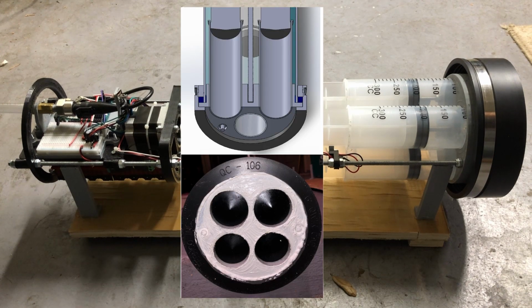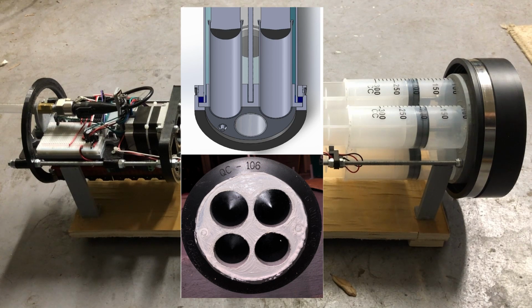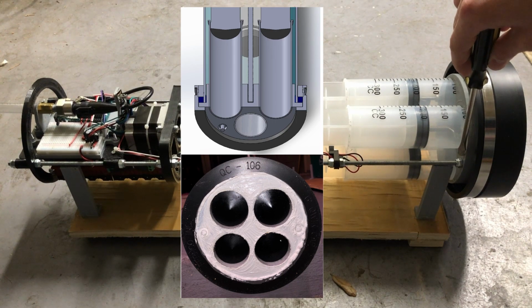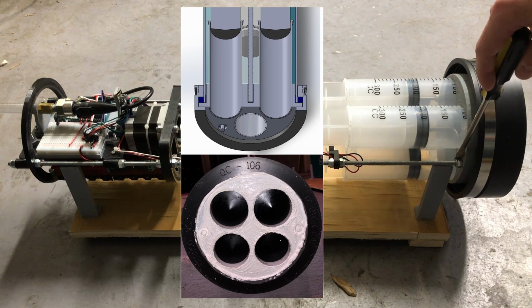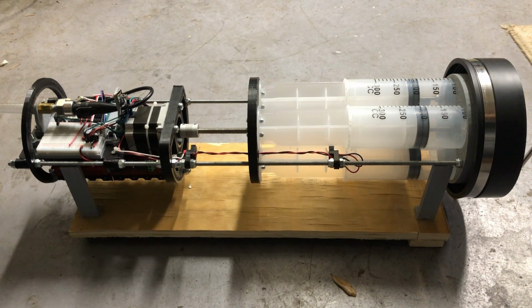And there is sealant along the inside of the head end cap. There's a large hole in the head end cap that the head block sits in, and it's sealed into place. Sealant is laid, and then the head block was put into place for watertight sealing, as well as the carriage rail holes that go through the head block. There is sealant in those as well as filling the pilot hole that the bolts on the face of the head block are in.